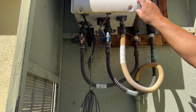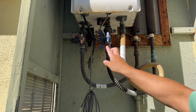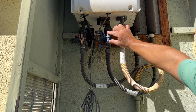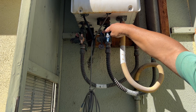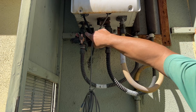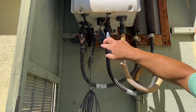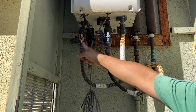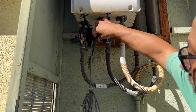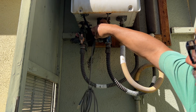Let's take a closer look at how the tankless water heater is plumbed. You have the gas supply line with an isolation valve, then the cold water supply line coming into the tankless with an on/off valve and a flush valve on the side. As the water goes through the heater and gets hot, it comes out and goes into the house through another isolation valve.